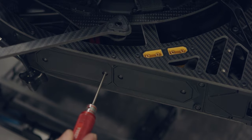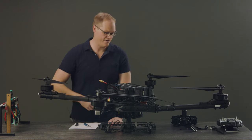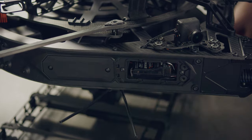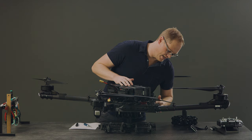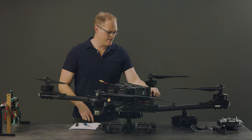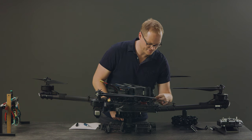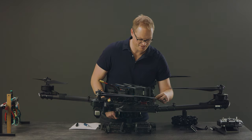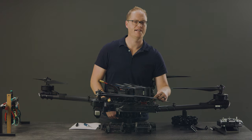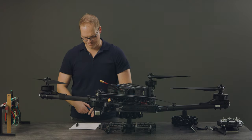I'll check closeout panels, making sure the fasteners are tight and not falling out. For quick-release closeout panels, I make sure the plugs fit tight in the grommet and really latch in securely. Next, I look at the FPV mount, making sure all fasteners are tight, the vibration isolators are in good shape, and the wire is still strain-relieved nicely with no chafing. FPV has historically been a pain to troubleshoot on set, so I always want that to be dialed and robust before showing up to shoot.